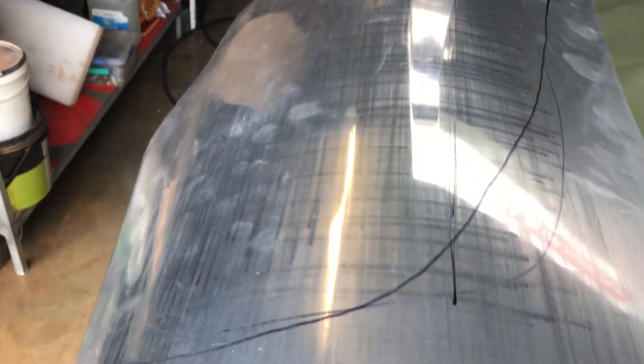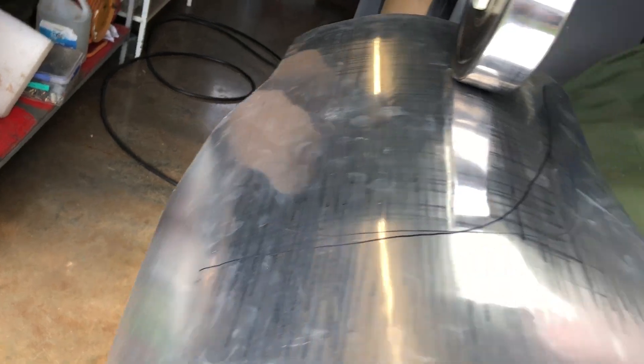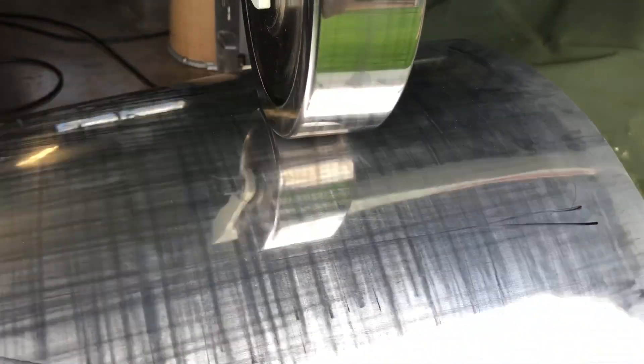There's still a little bit of a gap this way — not as bad because I need my other hand to hold it in the right spot. That edge is quite flat there, so we're actually almost there on this piece. Up here I'll just shrink that a little bit more to make that touch properly. There's only a slight curve but over a big area and we're nearly there. I'm drawing an extra line here as a guide as to where I need to work more. Basically we're rolling it back and forth this way, all the way around and up here, then we spin it and roll it that way — up and down — and that'll lift more up that way.